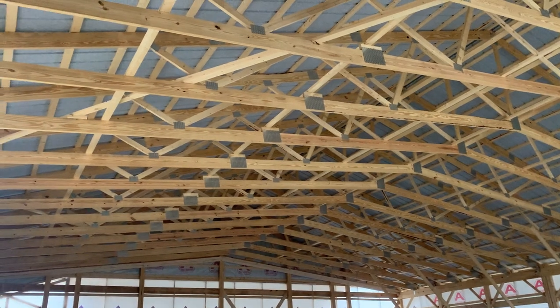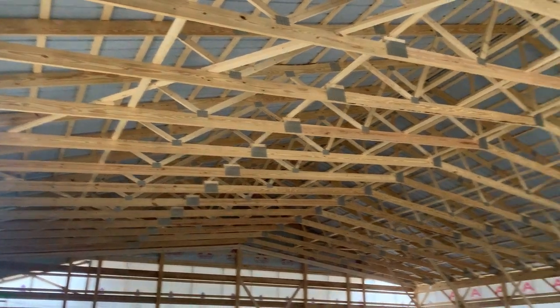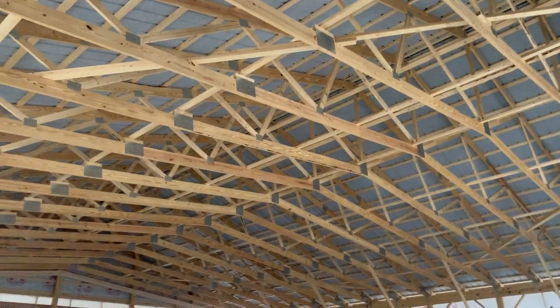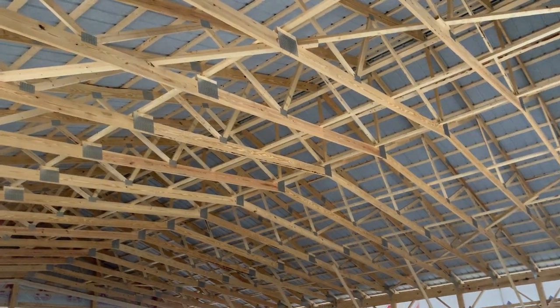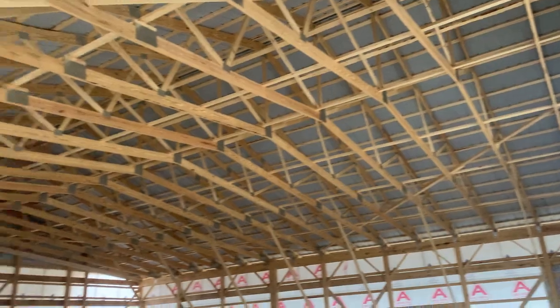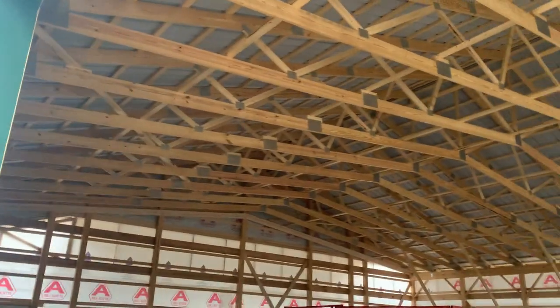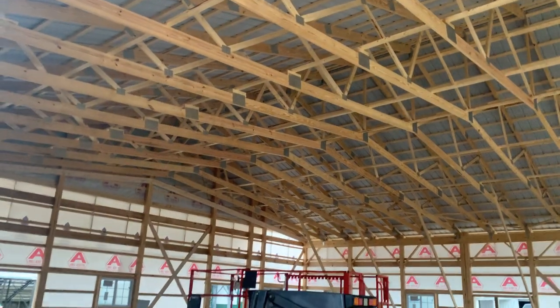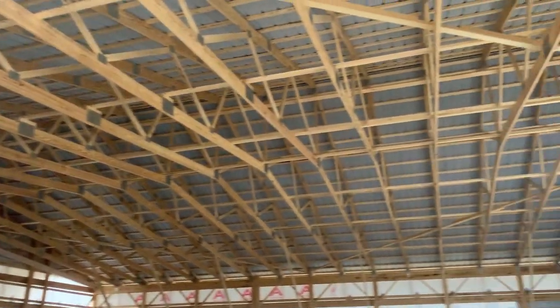That dirty dial — I've said it before, but it comes with a 20-year guarantee. Proof for animal confinement; this is not going to be an animal confinement building, but it's easy to wipe down and pressure wash. You can see here the progress — a nice layout. Scissor trusses just give it more headroom. It makes it look bigger. 60 by 64, 16 feet tall — pretty good size here.